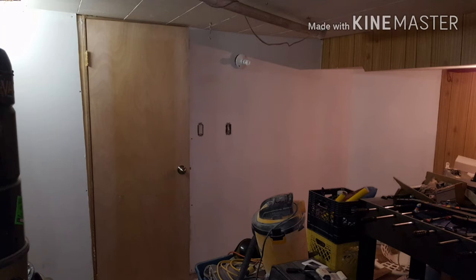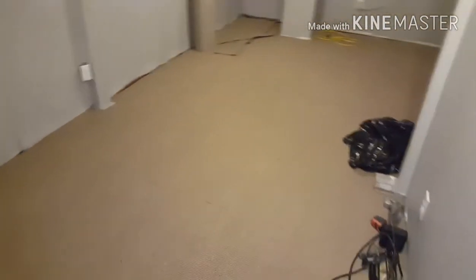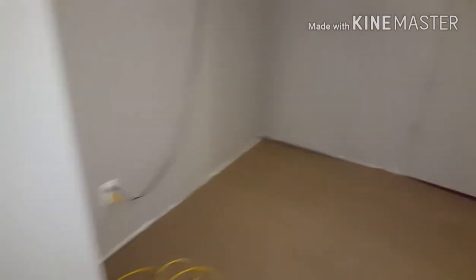We're just trying to find space in other buildings to get rid of the old stuff. In this picture coming up, you'll see what I meant — we had to dig up and take out all the heaved and crumbled cement that was there. It was probably not sulfate-resistant cement they used — it would have been just regular Portland. With some of the soil around here we do have saline in it, which causes cement to break out. Now here's a walk-around video after all's done — I'll paint it up, got the flooring in, and it's starting to look pretty good, going from basically a junky basement to two very nice rooms.